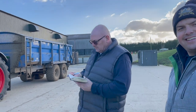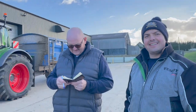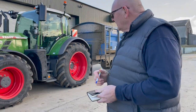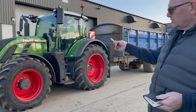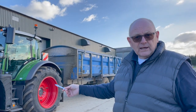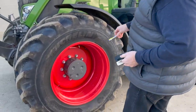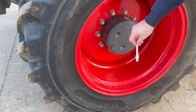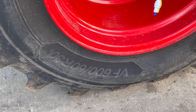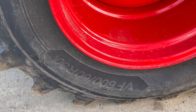We've got here today Ian Whitwell from Michelin — thank you for coming — Ben and George from PMB's. So can you talk us through what we're going to do? We'll go through tyre identification — basically so you know you've got the new technology. You've got VF in front which stands for very high flexion. The next part, 600, is in millimetres — that's the actual width of the tyre.